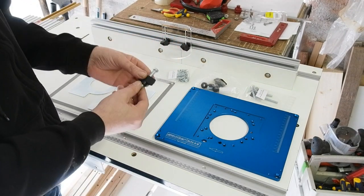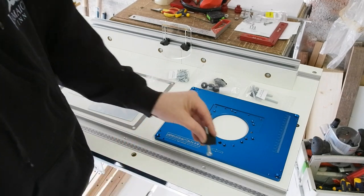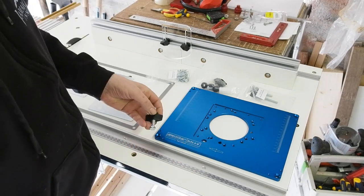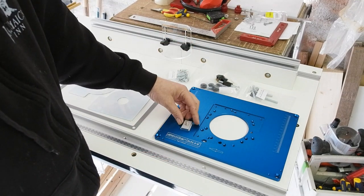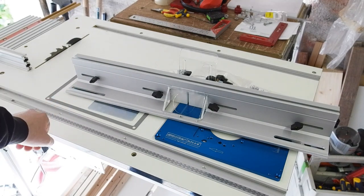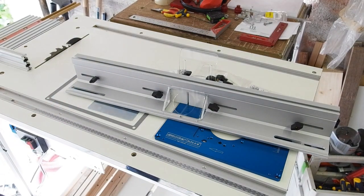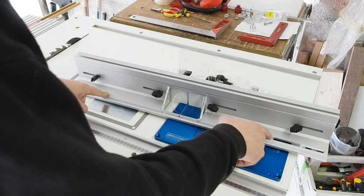Sorter supply 8mm bolts and wing nuts for fixing the fence to the appropriate track, but as I have 30mm track with 19mm slots, I'll use my own fixing option. Whilst the mounting slots in the base of the fence are generous, this being an afterthought to my build, they will unfortunately need extending a little to match the track I've already installed.